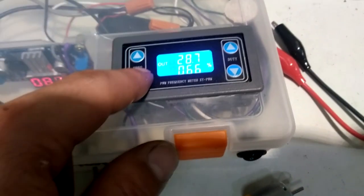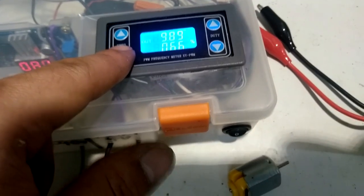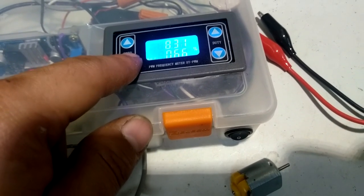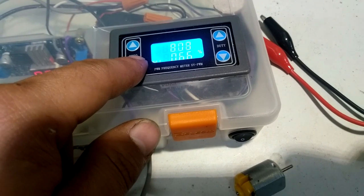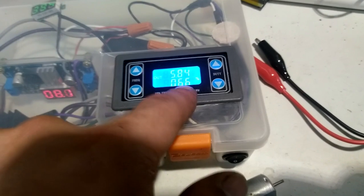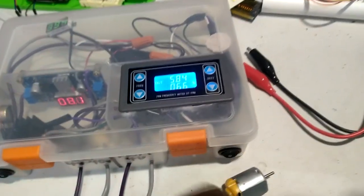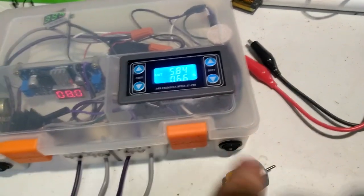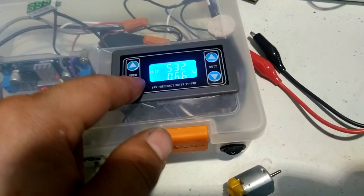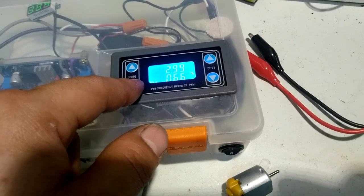So, back down on the frequencies we go here. We shoot way up. Way up. Way up. See, that higher duty cycle, longer on time, is being allowed more juice, more oomph per pulse now because there's fewer pulses over time. It's what this particular motor wants.